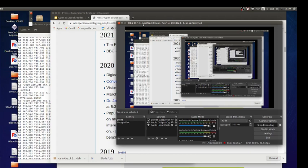But what's that mean? Adobe, as a construction method, they do like 300 PSI. That's their blocks for building homes. We have 600 out of the box. If you stabilize it with some cement, it goes up to about, we measured things like 1100 PSI. But yeah, plenty of strength.